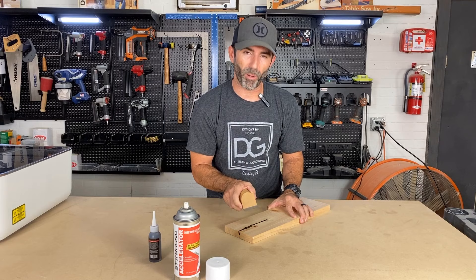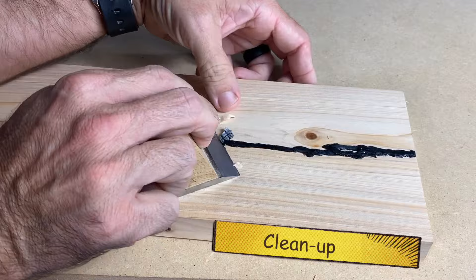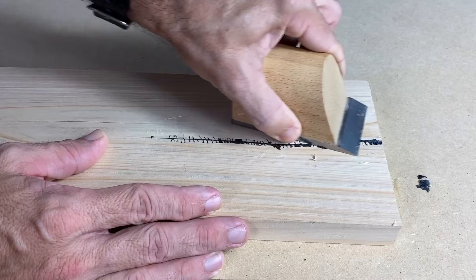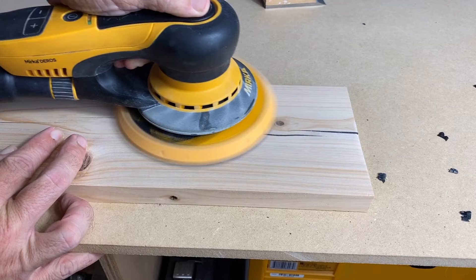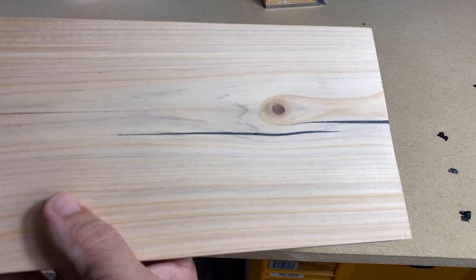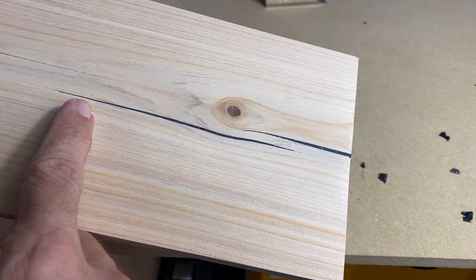This was a deep crack, so I'm actually going to use this block chisel to scrape off some of the excess before I sand — just makes it cleaner and easier. If you don't have a block chisel, just use a normal chisel; both work. Use your sander to clean up the rest. The crack looks pretty good for a nice quick easy repair.